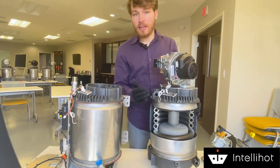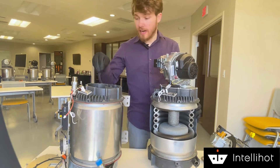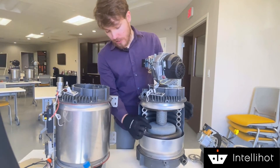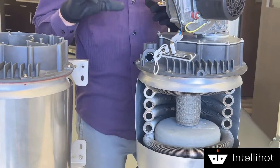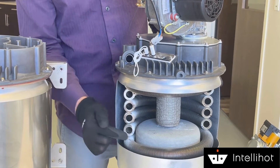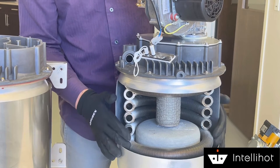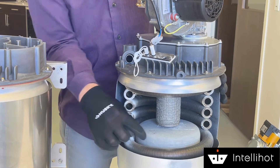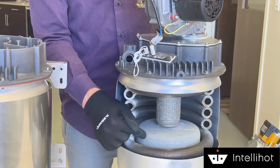I've pulled up a heat exchanger cutaway so we can actually see what's on the inside — it's very hard to look down into the burn chamber on video. If we were to actually look inside the burn chamber, what you're seeing is ceramic. The ceramic is a big thick piece of insulation which helps separate our two passes of the heat exchanger. You can see the 316L stainless steel coils that are wrapped around on the inside. There will also be a bead of sealant that runs around the interface between the coil and the piece of ceramic.